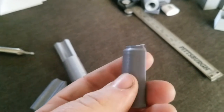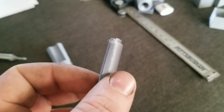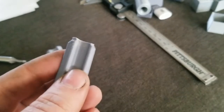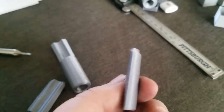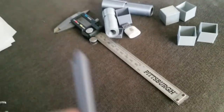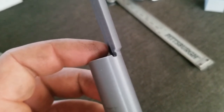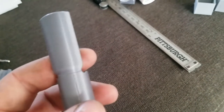So the only thing I can come up with is I can extend the taper further down so that there is more material there, because I necked it down where it snapped at, and I could continue extending it down just for sheer thickness purposes more than anything, and that would help it out a bit, because, you know, it would still flex if I just get rid of that chamfer and just let it continue down. But not sure at the moment.